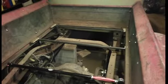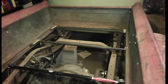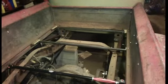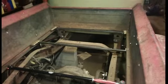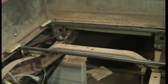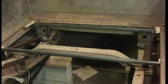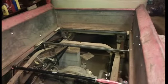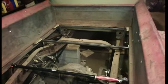I have the bed put on and made one-by-one tubes coming across to support it, with three-quarter-inch pine on top just to take up space in place of the oak that'll be there later. I put a piece of angle iron going down from the second support from the front to the front, and that stiffened everything up so the bed doesn't tilt front to back. None of the bolts are tight yet — the bed is pretty firm in the front but not in the back because I don't have the back connected yet.